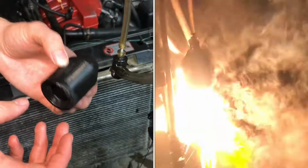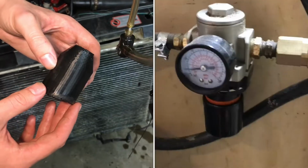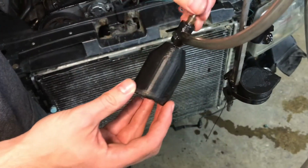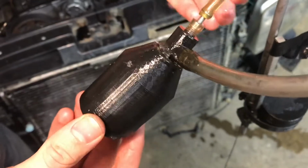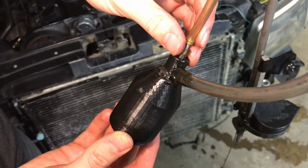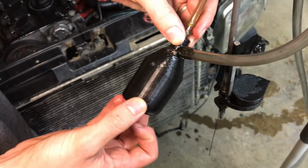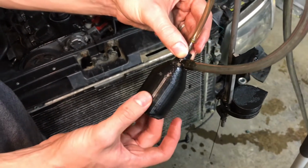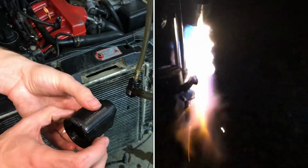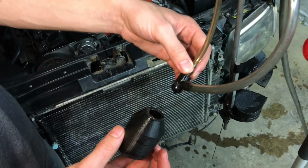We've used this chamber before, but this time we really brought up the pressure. It was at 17.5 PSI rather than around 5 we were doing before. Also, it came off. I guess there's two reasons that this could have happened. Well, it's only hot glued on there for this test, so it's not very strong. If we did have a lot of pressure inside the chamber, it could have popped off easily. Also, the chamber is actually still warm. Couldn't even touch it when it had first fallen off, so I'm sure that would have weakened the glue significantly.